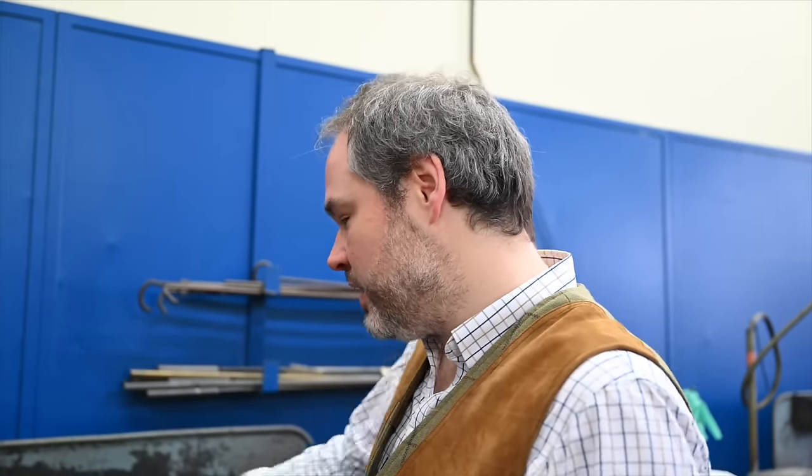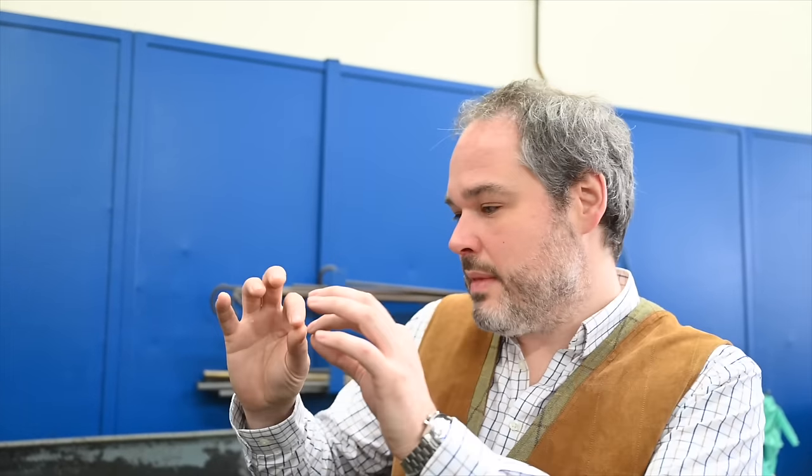Okay. Then he disassembles the barrel from the clamp, and with the light he checks the internal state. It's really important to do it by eye, because, as you know, we are on the FN facility, so we have all the lasers and all the laboratories that we want. But the best system to see any defect in a barrel is the human eye. We can spot something with our eyes that a machine in a laboratory can't. So he just uses a corner of a window, and he will make a really thin line of light in the barrel. And by turning it, you will see any defect, any bump, any marks, only by eye. It's the best system ever.